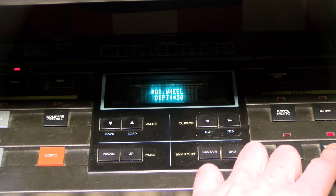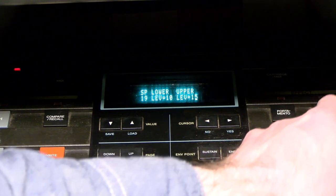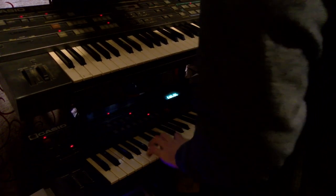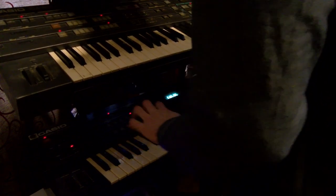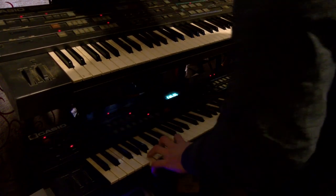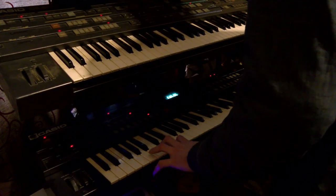It doesn't feel out of place, as VFDs were already rather mature and widely used by the time the instrument was made. They are a 50s invention. Only those older ones use significantly more power than our one here. It's actually quite efficient, all things considered. Indeed, I have to wonder if Casio might have even considered using one, but opted not to, as they would have needed to have a far beefier power supply to generate the voltages needed, and would also likely have had to include a lot of additional logic, as I'm not really sure this LCD emulator type existed back then. If it did, it was probably quite expensive.